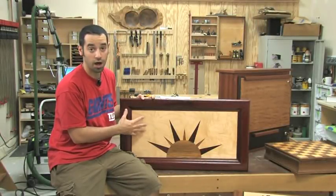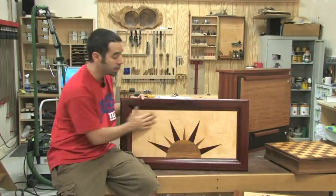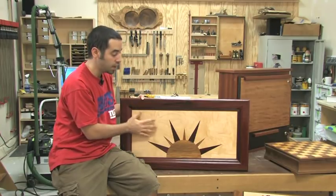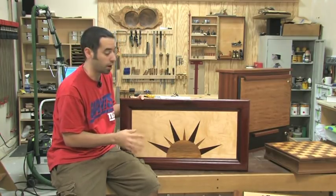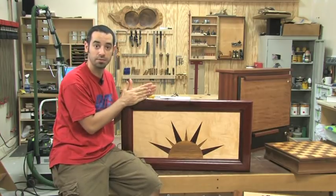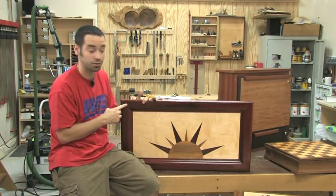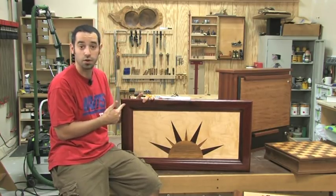Now this piece is what I like to call an ottoman tray. We had a big ottoman in the living room and no coffee table, so you need something for serving guests — and this worked really well. It's just a very simple sheet of maple ply surrounded by a carved padauk frame. Any time you encase wood in a frame, it's going to expand and it's going to blow out the joints at the corners — that's why you need to use plywood because it's stable. Had I used solid wood it would have been a nightmare, but since it was ply it's nice and stable. The joints are all really tight. I actually used splines inside the joints to keep them together, and even if you do everything right, you still will probably over the course of time feel a ridge where these miter joints are — and I don't. So we lucked out a little bit there, but you stack the cards in your favor if you do something like a spline or even just biscuits across that joint.